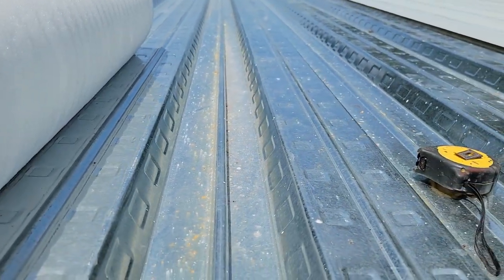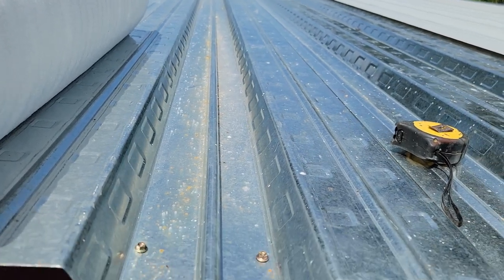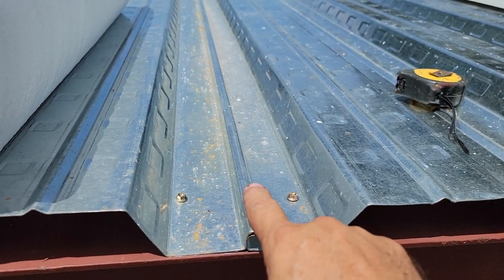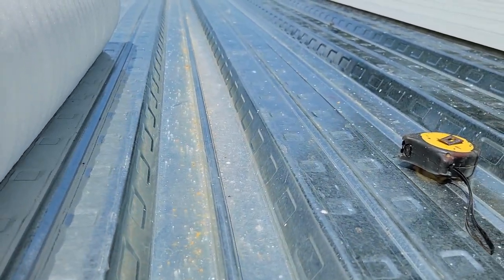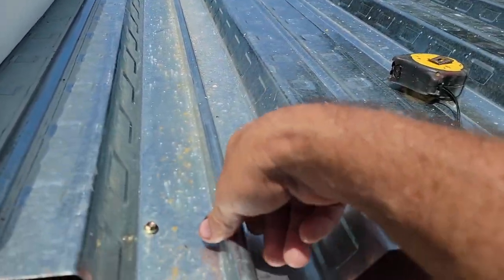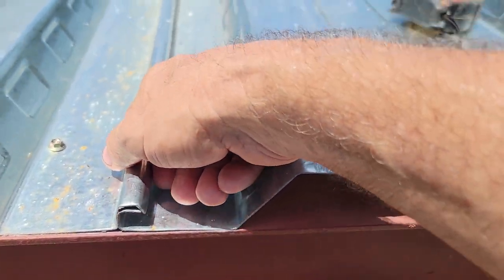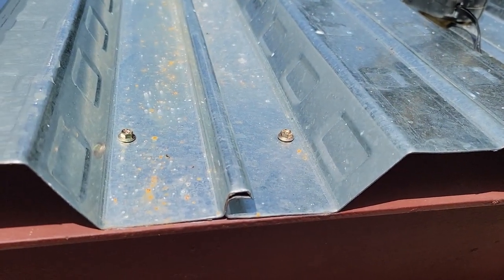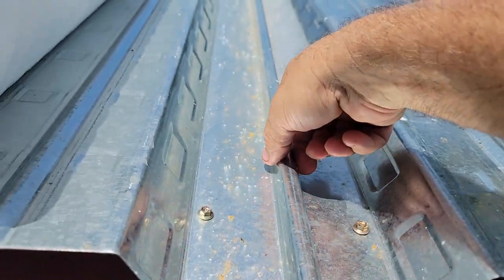So like on roofs on some houses and commercial buildings, they'll put a metal called standing seam that will be tall right here like this. And same thing, you get that all lined up perfect. You put that tool on there and it goes right down it and rolls a crimp down on that and seals that. So you can manually crimp it too. You can make yourself a tool or different ways you can do it. And you can go down there and do a manual crimp.